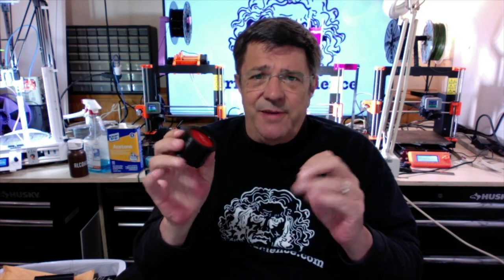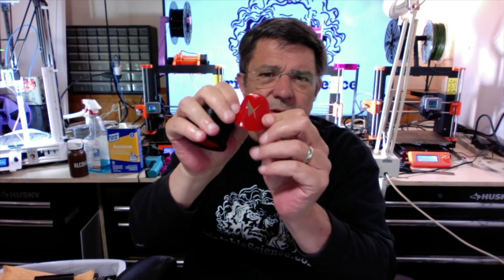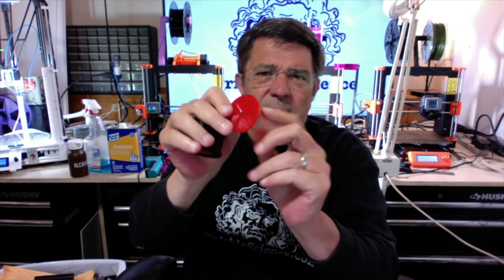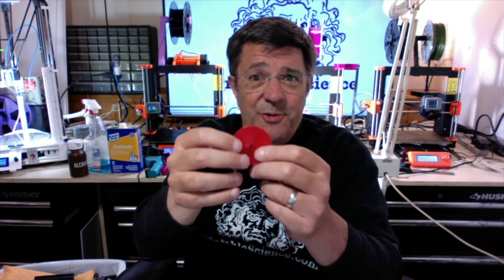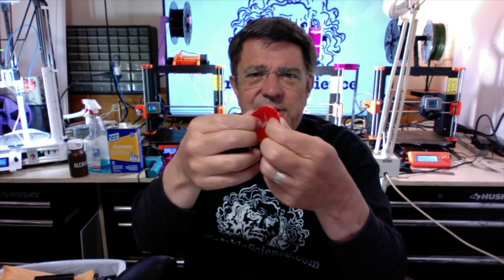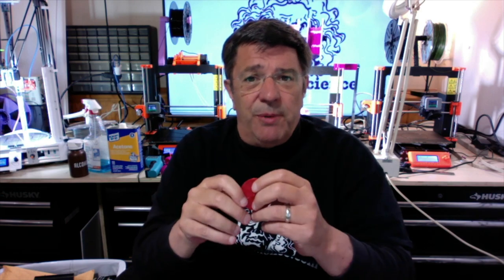The original was formed out of a single piece of plastic, and I think the holes for mounting it were on the outside of the cone, but my memory's a little sketchy. The design I came up with follows the same principle of operation, and that involves a flexible membrane at the top with a cross or star pattern that allows you to push a towel or a rag into the mount. When you remove your finger, the bent edges of the membrane grip the cloth and hold it in place.